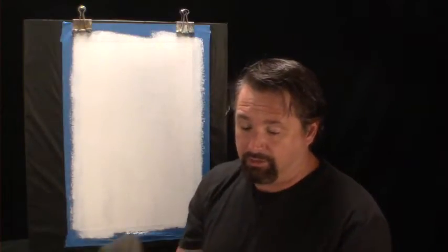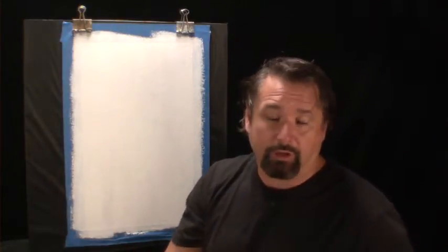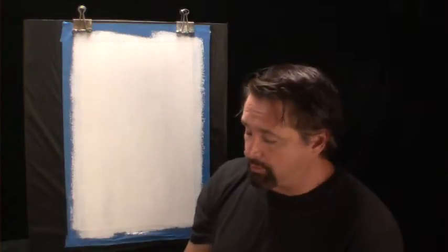Some things about the quartz primer: you're not going to get the tint to black, dark blues, dark reds. You'll get it kind of close, and that will give you a nice base if you're doing a black plaster like today, when I'm going to use this color called tricorn black. But the first thing I'm going to do is our trowel. Oh, and I rolled this on using a quarter inch nap roller.